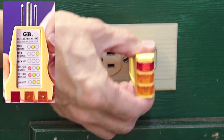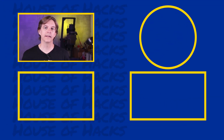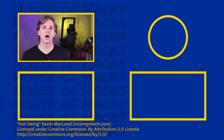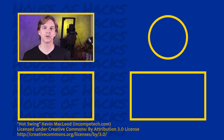The last one is hot ground reversal — this means the hot wire and the ground are backwards, which are the black and the green wires, or the plain copper one depending on the wire used. In that case just these two need to be switched around. That covers all the error cases and the good case, so make sure you use one of these any time you're wiring up an outlet to keep everything safe for your users.